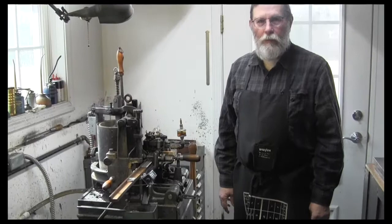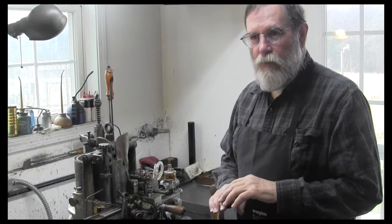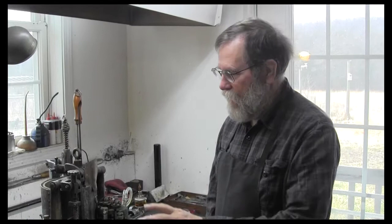It is on an electric motor. And we use water to cool the mold so that the body of the type is cooled quickly enough so that it can go in, get cast, and cool down before it's ejected out of the side of the machine.